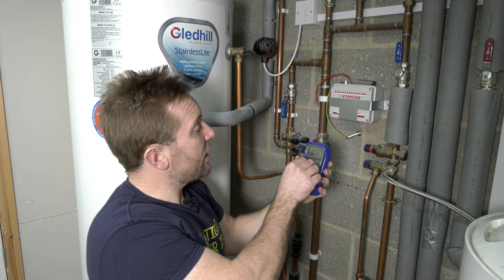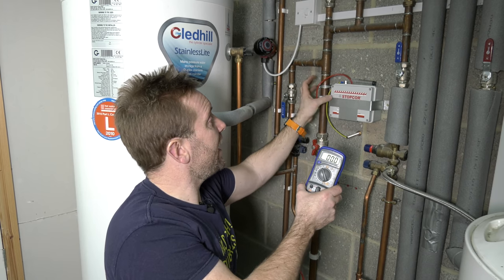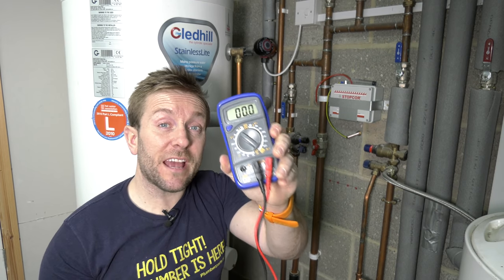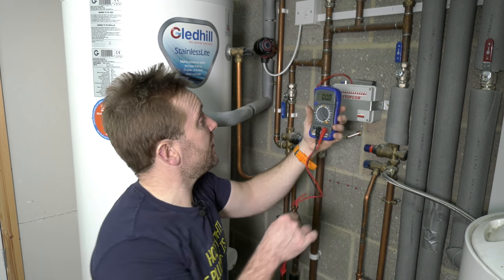So we're going to make sure now that we've got a voltage coming from this, feeding our ions and our electrons into here, and that small voltage coming into there, just by using this multimeter. So I've just got it set. What I want to see on here is anything over 1 volt. 1.2 volts would be fine. I'd like to see that, that'd be great.